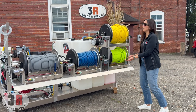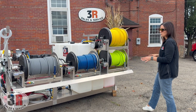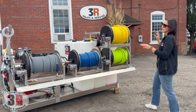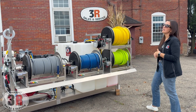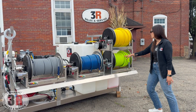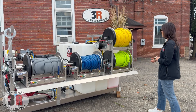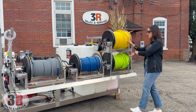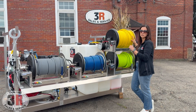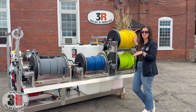On the passenger side, which is what we're looking at right now, this would be the front cab of the truck and this is the rear. We have all four of our hose reels accessible. These are electric rewind hose reels — all aluminum framed. The pressure reels, your soft wash one and your pressure washer ones, all have stainless steel manifolds so they're bleach resistant. On our garden hose reel we've got a one-inch manifold that helps feed the water tanks to fill them faster. We have 300 feet of soft wash hose, 100 feet of garden hose, and 200 feet of pressure washer hose on each of those reels. There are different colored hoses to differentiate between the five-and-a-half-gallon and the eight-gallon pressure washer so it's easy to tell.